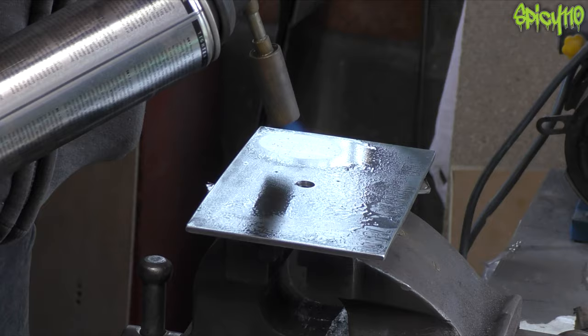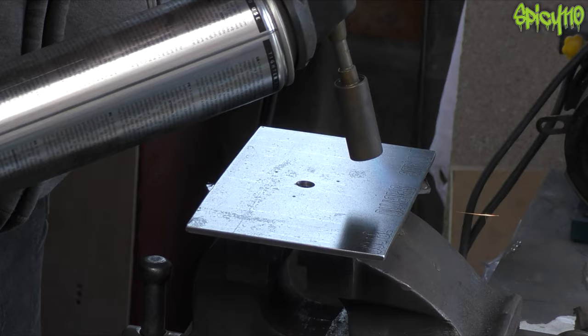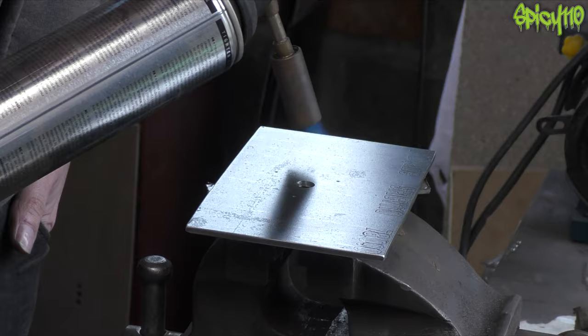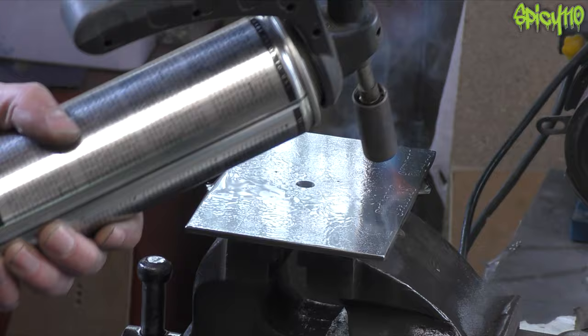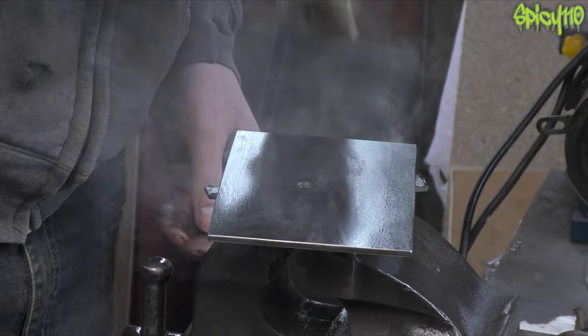Because of what I want to do with that writing, I need to discolor this backplate and also have the button and plate look different. This didn't go quite as well as I was hoping — it's quite a thick plate and getting it up to a really high temperature is difficult. I realized I'd probably waste 15 pounds worth of gas, so I got it as hot as I could. Then I use a great trick for darkening down metal: get it hot, spray it with oil or WD-40, let it sit, then clean it off. Going back over it and heating it in will create a film if you don't wipe it off before it fully dries, so I wipe it off with a dirty oily rag — it seems to nicely bring down the color of the metal.